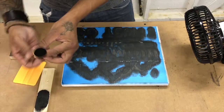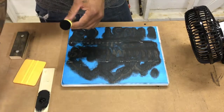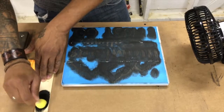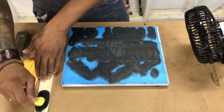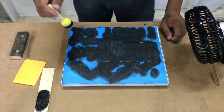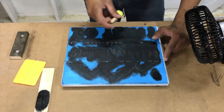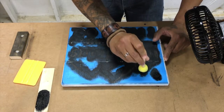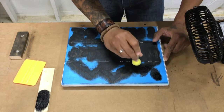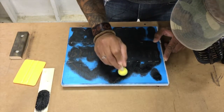And we want you to be able to say that you made it. All right, so for the last coat here, a little bit more paint, not much. That should do that whole sign for us because we are going to squeeze some of this out of here that's left in here. So we're going to load this guy up again just by dabbing up and down, and that's the same motion we're going to use on here. So practice on here, you'll see the coverage that we're going to get. Same thing here. We're dabbing, we're not sliding when we're dabbing because we're going to be pushing paint if we do that. But we're dabbing easy over the cracks. You don't want to squeeze it in there.